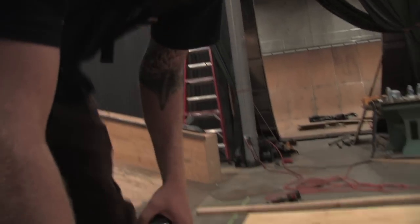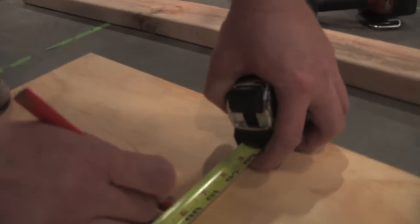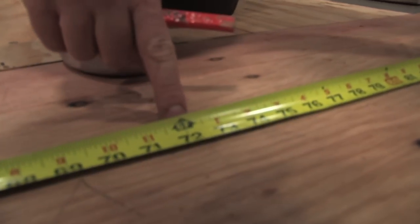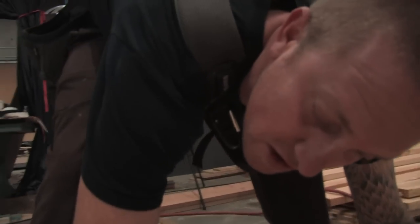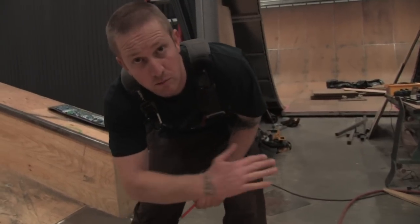This is where the transition is going to meet the flat bottom. So basically we're going to measure up 7 foot 6 inches and that's where we're going to put our screw. Right now I'm marking out my number for my height of my ramp. You want a full 2 inches under the actual 6 foot because you have coping and plywood and deck that has to go on. So now we've created a square and that's going to give us the points we need to swing our compass. Right now what I'm doing is popping a line for my transition number, which is 7 foot 6 inches. So this 2 by 4 is going to be our compass arm — we're going to mark it at 7 foot 6 inches and that's where I put my screw so I can swing my arm and make our arc.